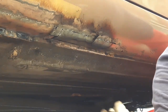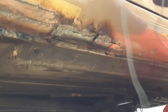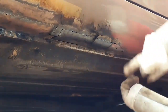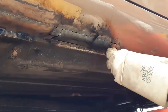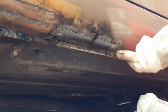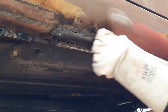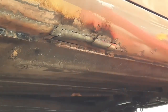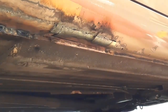I could be here for hours — this only gives the smallest sense. I can't film the whole thing because the films would be hours long. I'm actually going to need to file this edge here — it's about a third of a millimeter, it'll take about 10 minutes with the file. I'll be able to tap that in because it's overlapping with the original panel. I'll let it cool, dress this a bit more, get a few more tacks on, and then I've got to do the bottom as well. It's an enormously long process — I'm not going to attempt to film the whole lot, just trying to give you a sense of what's involved here.